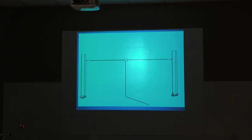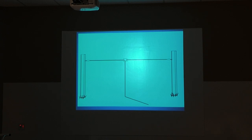That's another representation. That's a horizontal. And here's another quirk. The impedance at that point right there on a horizontal dipole is about 72 ohms. And back in the day, when some of us old folks were doing this hobby with tube-type radios, that's what the load control on the output of the final amplifier was for, to match it to either 50 ohms, 70 ohms, 120 ohms, whatever the type of antenna that you have. Can't do that with a transistorized rig. That's why they put tuners inside of them. And they will match that, and you won't have any trouble. But if you go much past 120, 130 ohms, they may not like it.